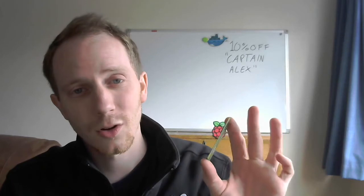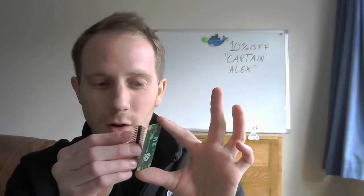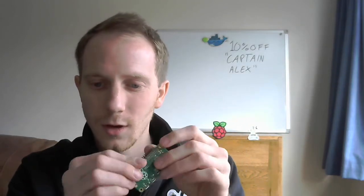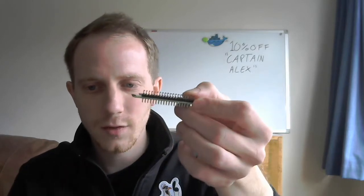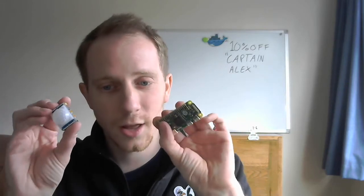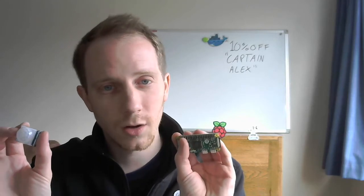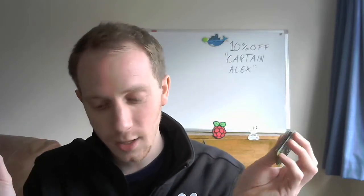I used this at DockerCon last year to produce a cool hack and showed it in the community theater. What that involved was soldering on some headers, and each of these pins can be controlled by software. That enables you to add something like a passive infrared sensor that you might have seen in a garden or security setup — when motion passes by it will trigger one of these pins high, and then in software you can send an email, light up an LED, or maybe take a photo.